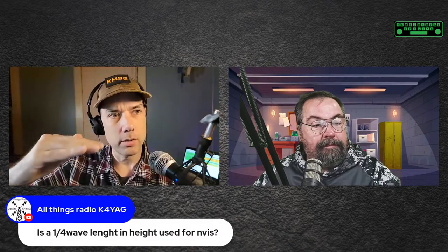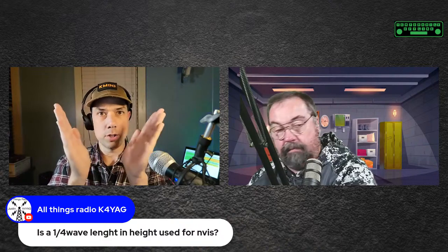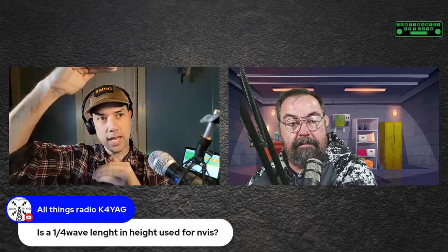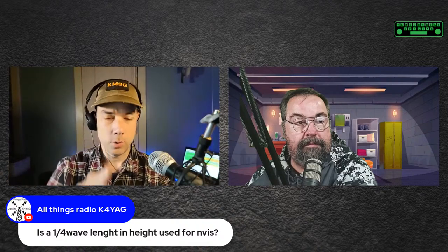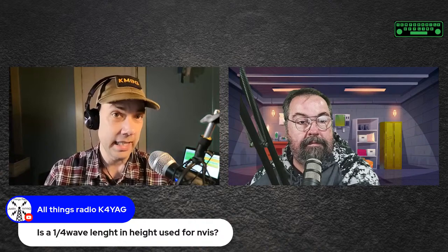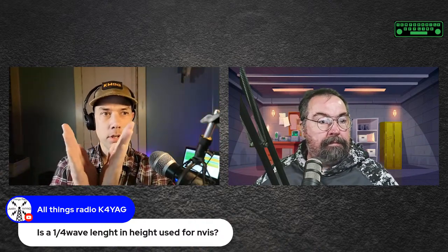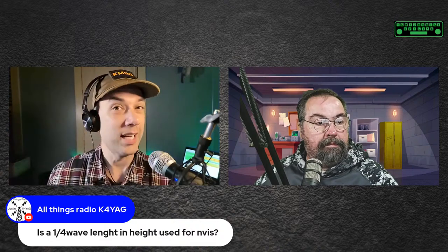Is a quarter wavelength in height used for NVIS? So NVIS is a generic term. The closer you get to the ground, the more narrowly focused your signal is going straight up. If you're a half wave off the ground, then your signal is going to be going out across the horizon. And if you go down and down, you can run your antenna right on the ground if you want. I don't recommend it. You probably make fewer contacts, but you're going to narrow your bounce, so it's going to go up and then turn around and come right back down. So you're going to be talking to your neighbors, which is a good thing sometimes.